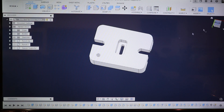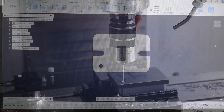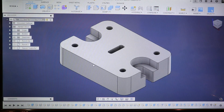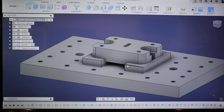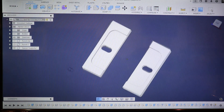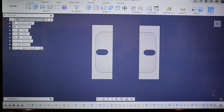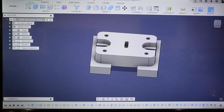And then this is a pass-through hole that I thought I would use to realign the part to get a new work coordinate system in my CNC mill, so that I could do my bottom operation — I did the top and then the bottom — to fix the problem of the slugs piling up. Instead of modifying the existing die, I decided to do these supports. They match the die with about a millimeter of play, and that is all they do. They pocket and hold that die in place nice and tight, and then they mimic the holes from that die to allow me to tighten this up to the fixture plate.